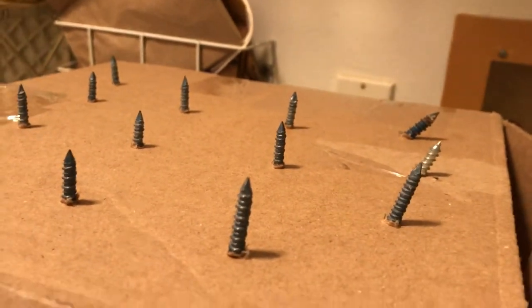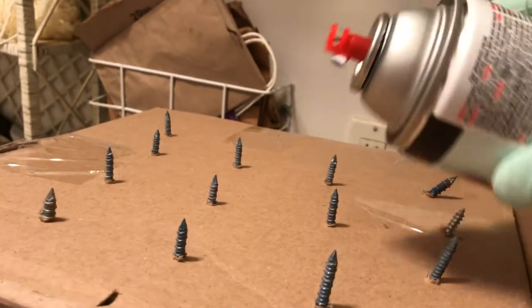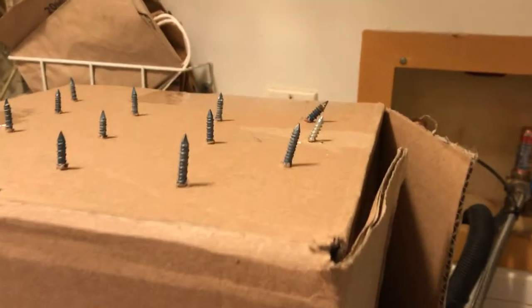There's a flaw with multiple rows: when I do a final coat, the back row is going to get overspray when I'm hitting the front row, and vice versa. So the solution is single file — no overspray. But then how am I going to elevate my knob? You don't want to rest your knob on any surface.